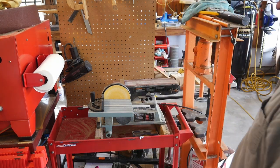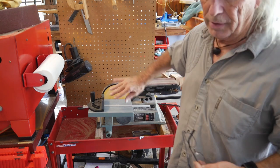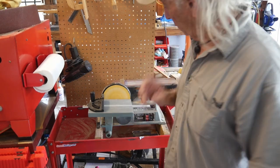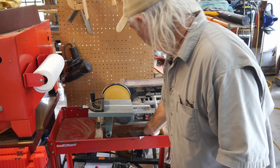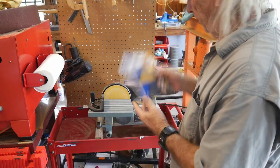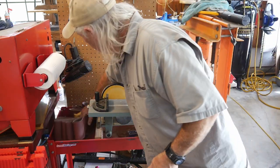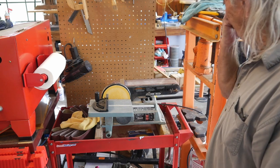This is the six-inch disc. When I cleaned off the old disc — they're held on by glue, they just stick on — the old stuff was really bonded, so I took regular Zippo lighter fluid, wiped it all down, got it nice and clean, let it dry, then stuck on a brand new six-inch disc. I ordered stick-it sand — that's a stick-on type sanding disc. I also ordered various grits of belts, 4 inch by 36, just in case anyone picks up one of these and doesn't know what size belt they take.